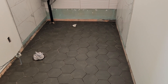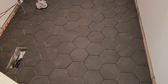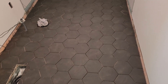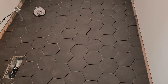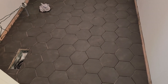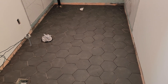Ladies and gentlemen, we have officially shop-vacced everything and washed it down — just a bucket of hot water, wrung out really well so it's nice and damp. I don't want water getting inside my grout lines because then it's going to take longer to dry before I start grouting. I have one spot still remaining to dry, so I'm going to leave it for another 10–15 minutes. This is high-altitude Colorado, so things dry out really quickly around here.